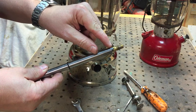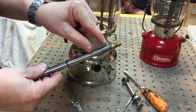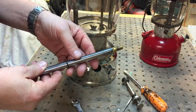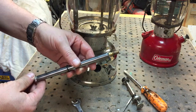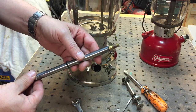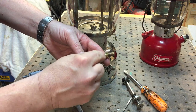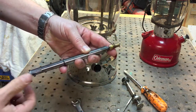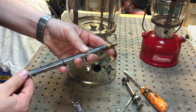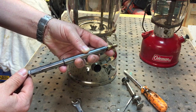You can see that this thing fits perfectly — the tang here, the prongs fit perfectly into the groove of the check valve, and that's a safe way to get it out. If you just use a screwdriver or a big flathead or a hammer or something like that, it potentially would get loose and damage the slot of the check valve. So that is a safe way to take that check valve out without damaging anything.